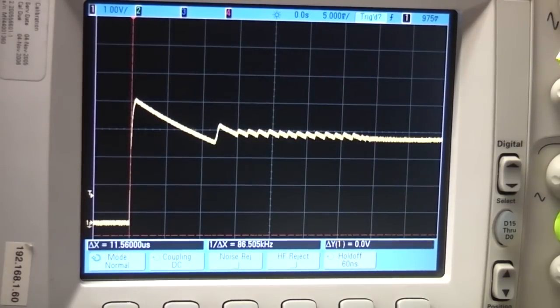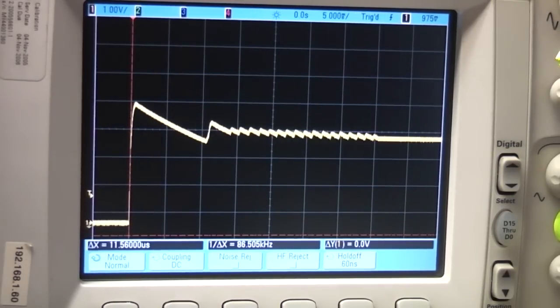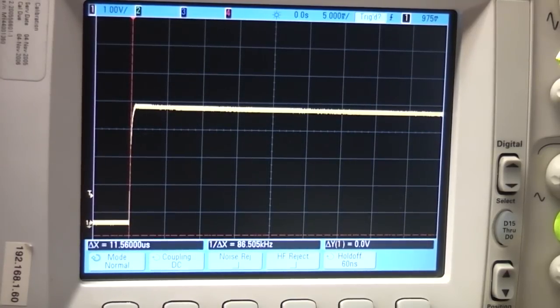Not quite so good. We've got about a 1 volt overshoot on that. Not brilliant, but probably not totally fatal. Just try it without the load. That's with a light load, just a 10k on 3.3 volts, there's no overshoot at all, so it looks like it can sometimes overshoot a bit if it's got a fairly high load at startup.